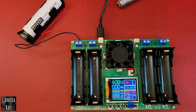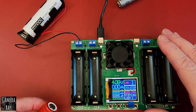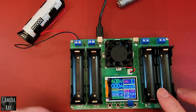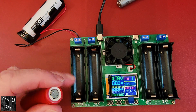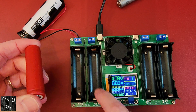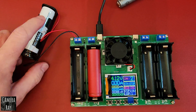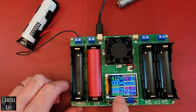You can also use a second power connector on this side, which gives you a higher charge capability — it'll charge at a higher amperage. This one is connected to the left bay with the larger battery. Be careful with negative and positive on here — on this one the positives are facing towards you. So I can put a second 18650 battery in the next bay and it'll work fine alongside the larger battery.